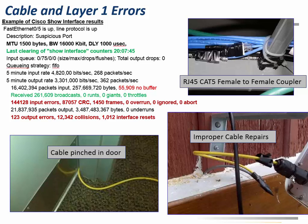We had a wireless bridge outside a building for a customer, and when we went back to check why it wasn't working well, we noticed the customer had done some handiwork. You can see the arc on the bottom of the unit, which is not a good sign. Improper cable repairs is something else to look out for. When you do your show interface commands from Cisco or Juniper, please pay attention to the statistics — understand what an input error is, what could cause that, a CRC error, that sort of thing. It gives you an idea of whether it is a layer one issue or not.